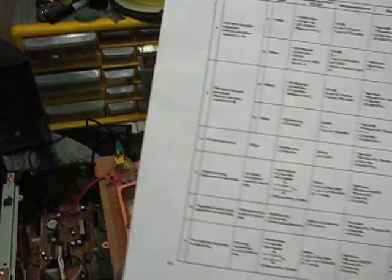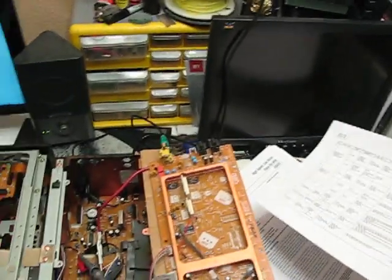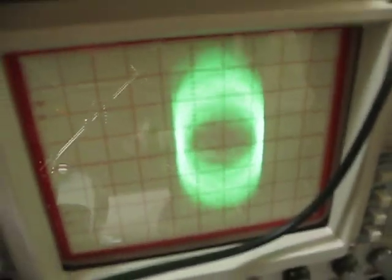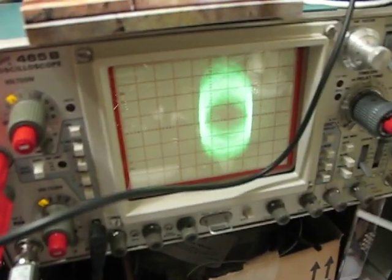We're doing right now the track servo loop gain adjustment. And the idea here is fairly straightforward. Well, sort of straightforward. It's quite gnarly, having to align up anything. But I use an audio oscillator, inject a signal into a certain pin on here, measure that signal, and also measure another signal coming out. And you display that XY on the scope. And which one is the most round figure? That's what we've gained here. This is pretty much as round as it's going to get.